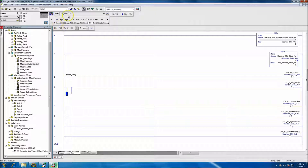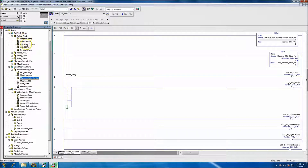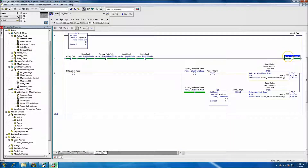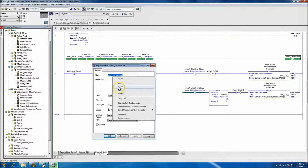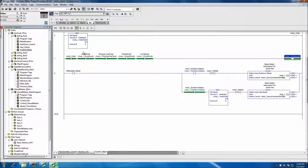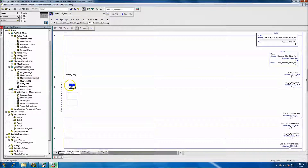I want to show exactly what I'm talking about. If you recall, in the axis program we had a control summing bit — if nothing was faulted, it sums up and says the axis is okay. We want to use that in our servo coordinated motion system. If any axis goes into a fault, we want to shut the machine down. So in the instance that any one of the servos is faulted out, or if we have a gearing issue, we want to handle that.